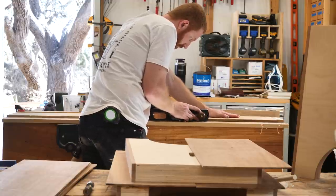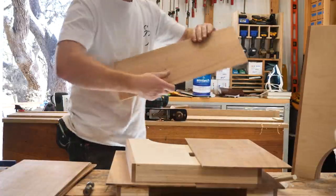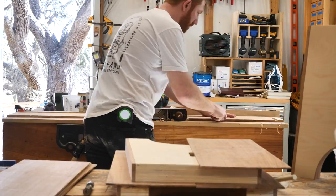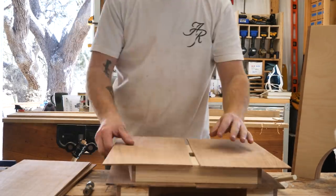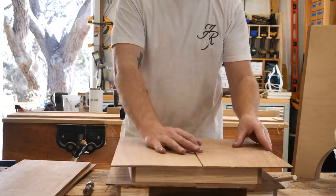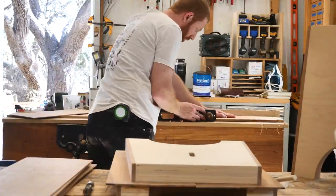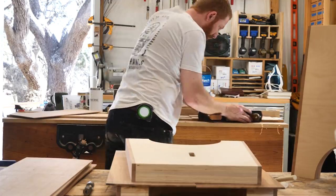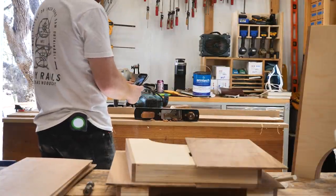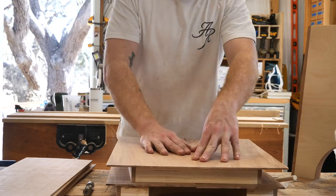All right, so as usual, Robert picks things up pretty quick and easy, so he was able to knock these out without much of an issue. There are several different ways you can do this process, but I find that the shooting board is the most enjoyable and, honestly, the easiest once you figure out how to do it. You can also set up a jig and use a router with a straight piece of wood or plywood and a flush trimming bit, and you could do multiple pieces that way. But I prefer the quietness and the no-dust method of just using the hand plane. Super enjoyable, and it's a good skill to have. A lot of y'all are hobbyists, and with a hand plane and a quick shooting board thrown together, you can do a lot with this particular tool and method.